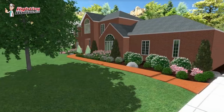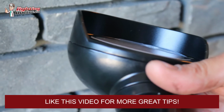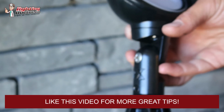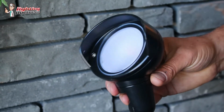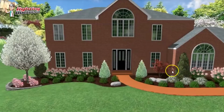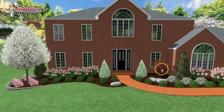I'll go through this area as well, but on the front here, another light that you're going to want to use a little bit is wash lights. Now, I'm a bigger fan of trying to use different kinds of uplights as opposed to path and garden lights. Say, for example, I've got a smaller tree in the corner here. I've got my light here, but there's not going to be much in this area, and this looks like a bit of a dark spot. So if I can get a wash light more on this side that's shining and highlighting this tree, because it's not as tall, I don't need as bright a light. I want a softer, subtler, wider light. That's where a wash light's really good. It shines through and creates some shadows, and again helps bring out some of the subtlety in the brickwork over here.